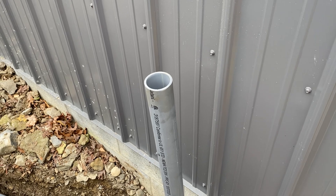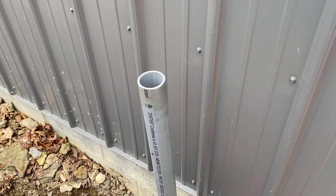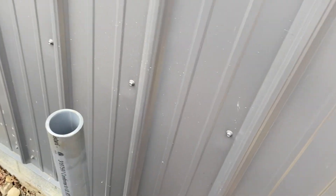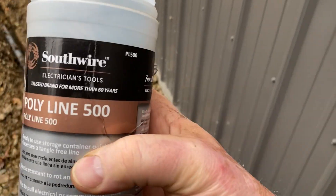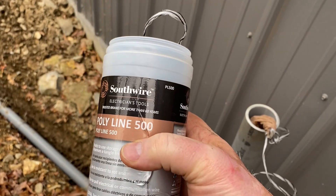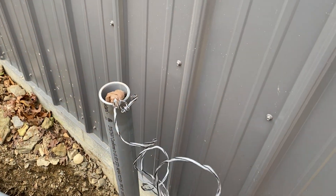Today I have about a 215-foot run of two-inch conduit that runs below grade, and I need to get some rope through it so I can pull my service out to an outbuilding. Here's what we're going to use: just a plastic bag from a grocery store, shoved down into the hole. On the handle of the bag I've attached a pull string — this is Southwire pull string from Lowe's, made for your initial pull for wiring conduit.